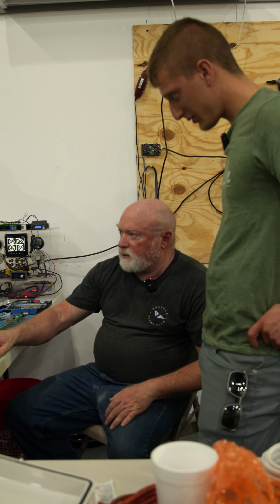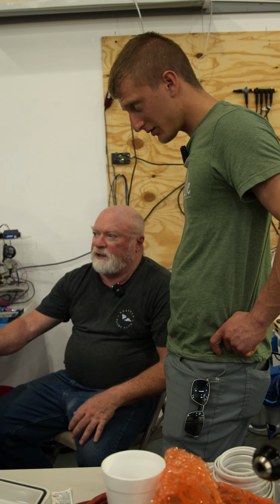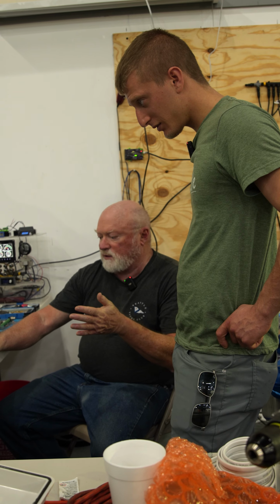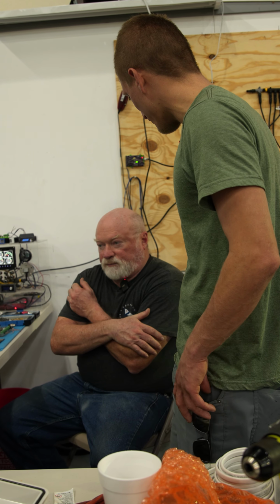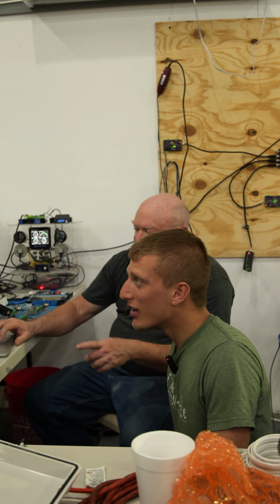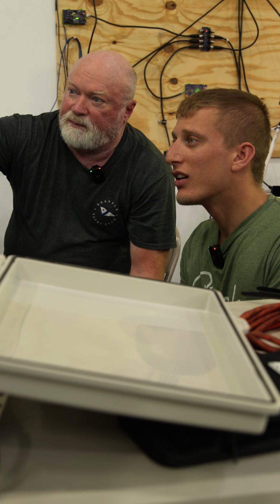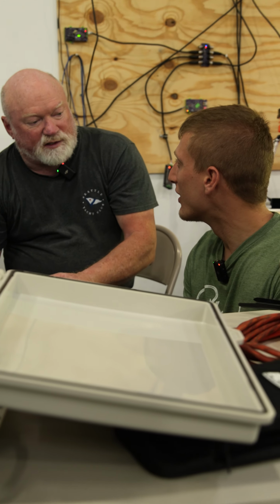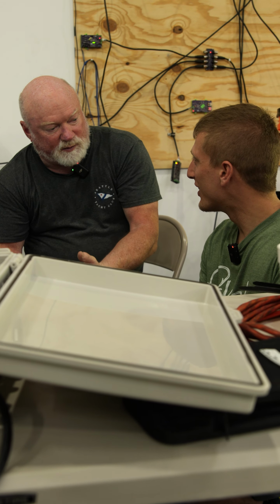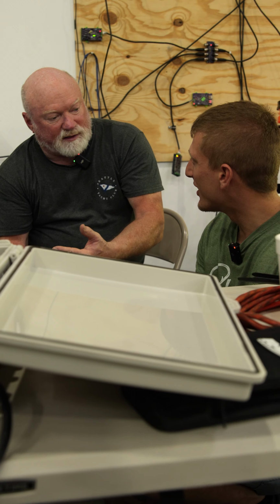And so, where is my mouse cursor here? All right. Up in here you can set all your settings. It's password protected for administrator. You can set this whatever you want. It's essentially set up like a wireless router. And it has basic sensors, pressure and flow sensors, as the controller type. And you can enable Mom, the supervisor, that tells you if anything goes wrong, it shuts down. If the stopcock is closed, there's no booster pressure. If the circuit breaker for the compressor's off, it tells you that.